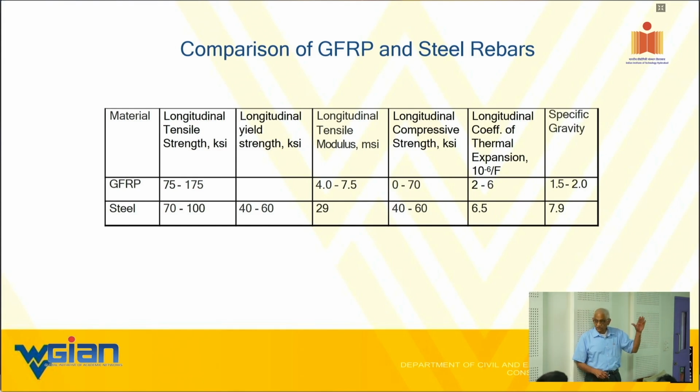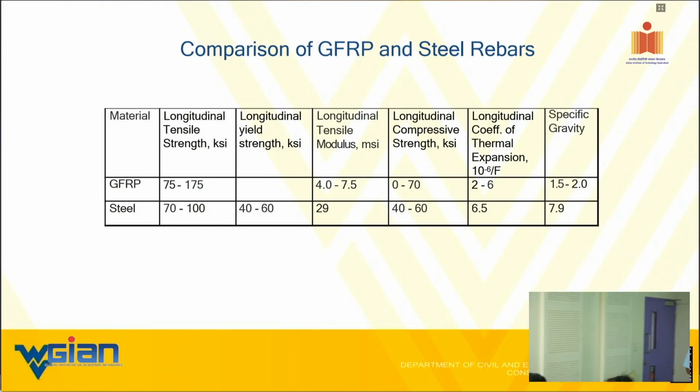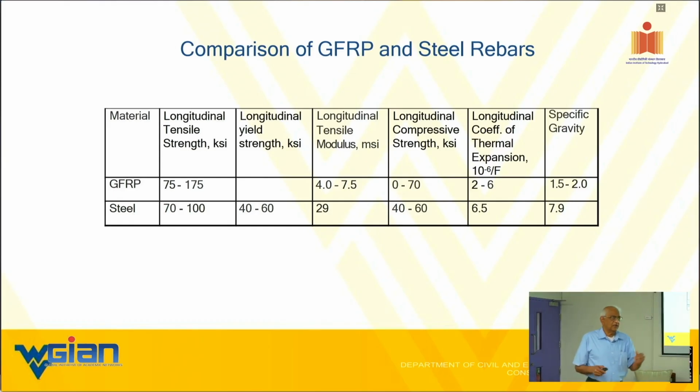That's why I stopped talking about it once I got into my chapter 3, where I am talking about the laminate theories and what have you. So here we don't even have to worry about a laminate theory when it comes to a rebar. Are you with me? These are for E-glass. Doesn't matter. Go to S-glass, for example. Say the 60%. What are you going to do? 0.6 times 14 MSI, 8.4, right?